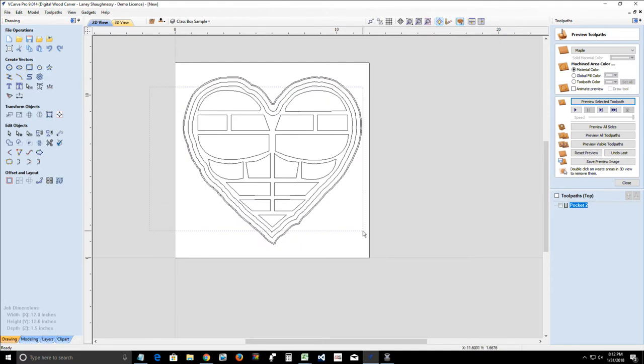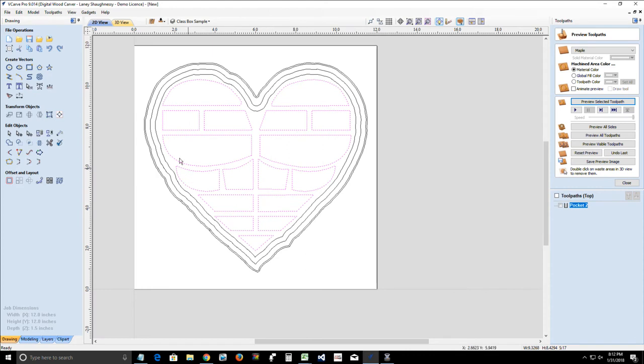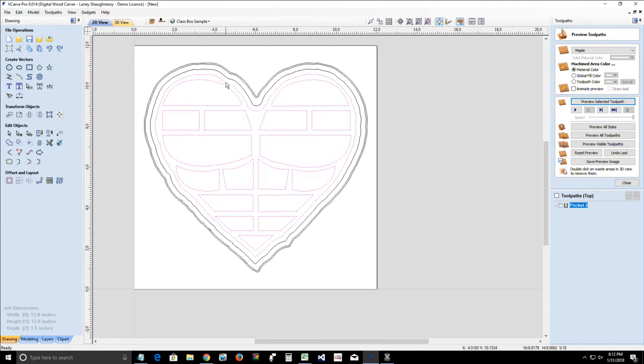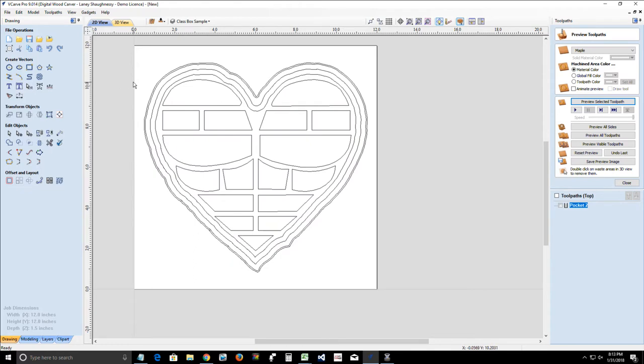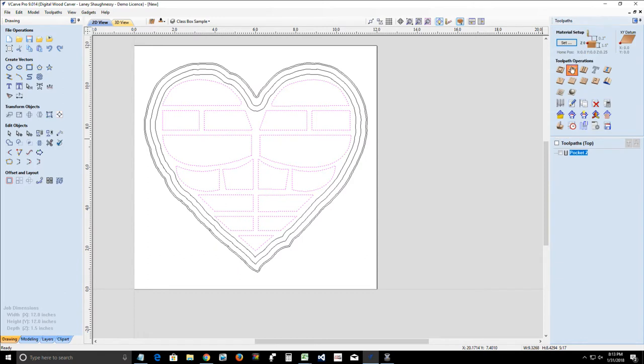And again, if I'm not 100% in that selection window drawing from left to right, it will not select any of the lines it crosses, only what is 100% within that selection window. Okay, notice how those hearts were 100% in, it selected them. So if I come down and just barely miss, not my inner part, just barely miss that, it'll only select those inner parts there. All right, this also is going to be a pocket cut.